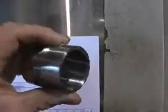I did one just to set up the lathe, and they come out like that. So you have an external thread, an internal thread, 1.6mm pitch inside, 1.5mm outside. I think they're going around the brewery or something like that.